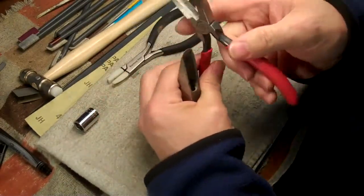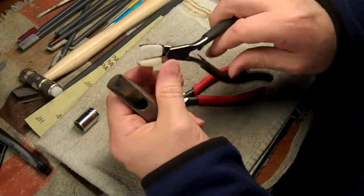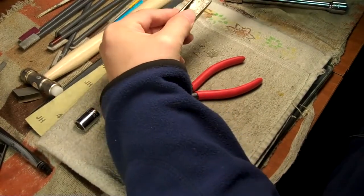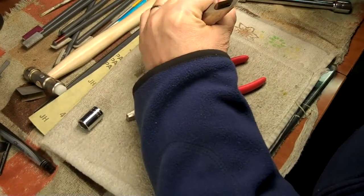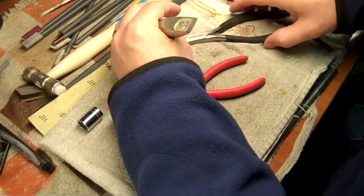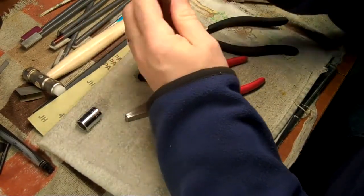A pair of pliers. You want to avoid pliers that have any kind of serrated jaws — these are flat. They'll still leave a mark in there, but you can do some bending. It's probably better to get a pair of nylon-jawed pliers because they'll leave less of a mark to clean up later. So I'm going to try to bend that back. I just got out a whole bunch of it right there. The bite plate just popped out, but fortunately that'd be easy to put back in. You can make another one or get it back in. So I've already gotten quite a bit of that — I probably went a little too much and we can open that up a little bit.